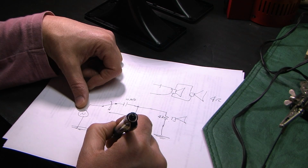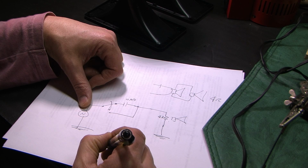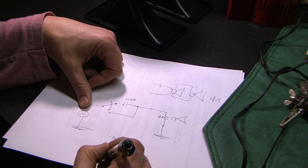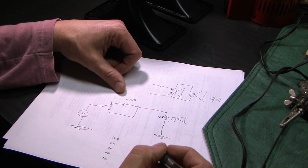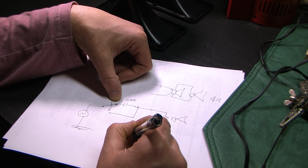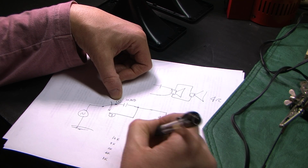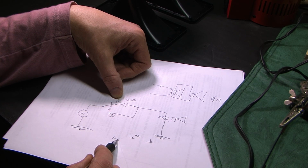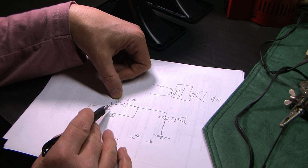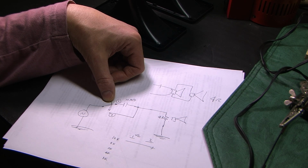This signal generator, I'm going to run some frequencies. I'm going to like 10K, 8K, 5K, 4K, which is what I designed it for, and we'll say 1K. And what we should see is at 10K, I'm going to say position 1 and position 2. 1, 2. Okay, 1 is with cap, 2 is no cap. So at 10K, this capacitor should have little to no effect on reducing the output. So when I go between position 1 and position 2, it should be the same acoustic level on the output. It should have little to no effect.